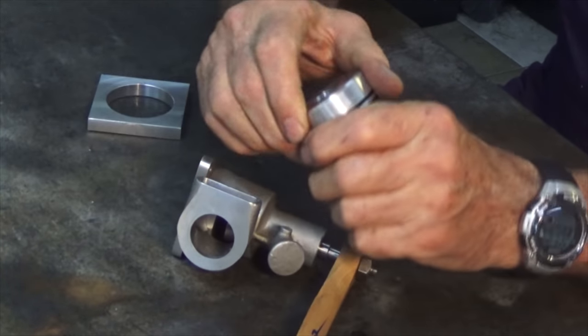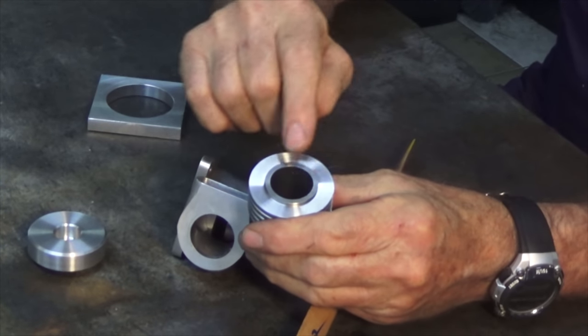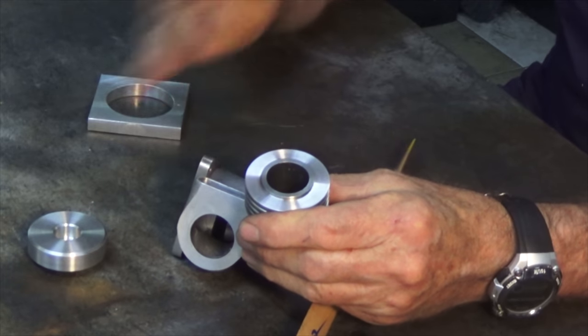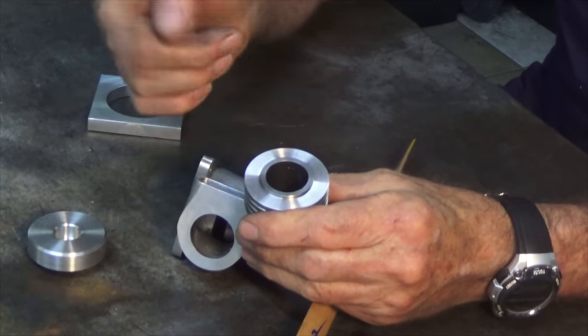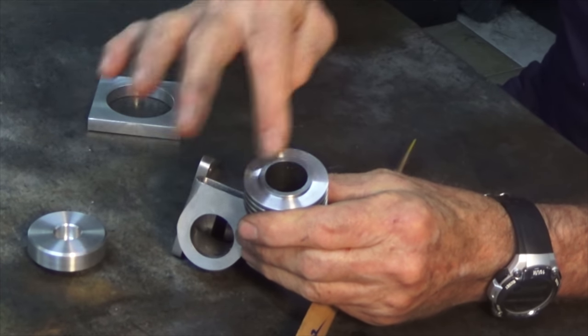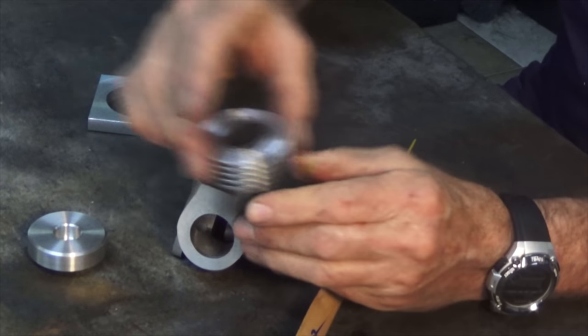So some people are concerned that when the engine is running, the differential expansion between these 2 metals might cause the liner to come loose. Even if that were to happen, it still can't move. So the designer, George Ginevra, thought about all of that when he stipulated that we're going to have 6 screws, but 3 in the cooling fin stack and 3 in the crankcase.